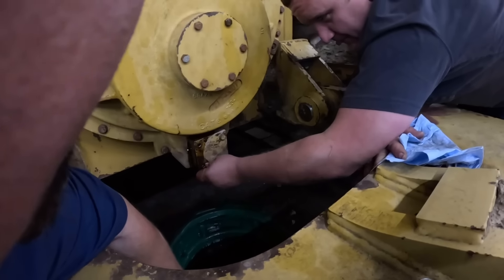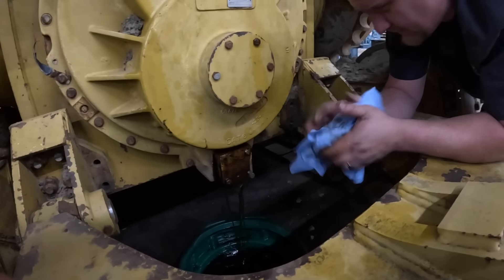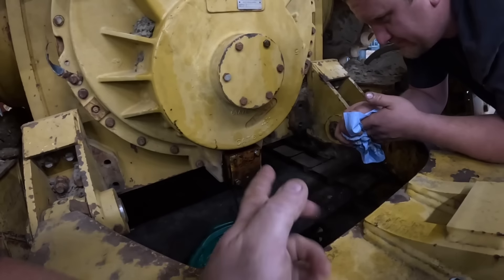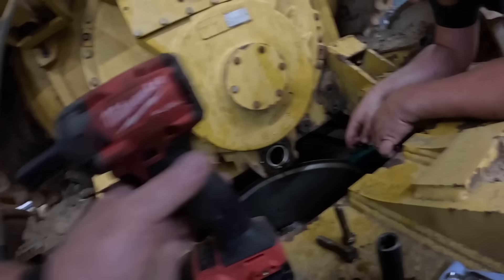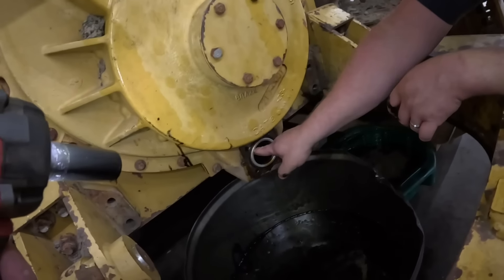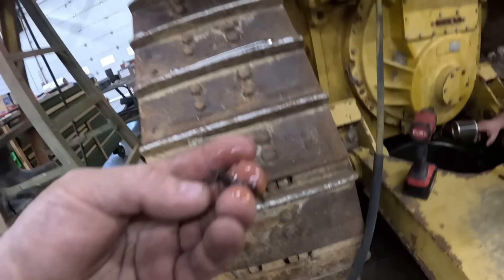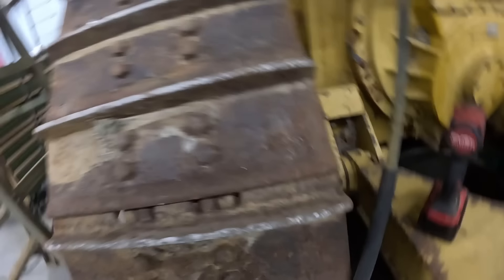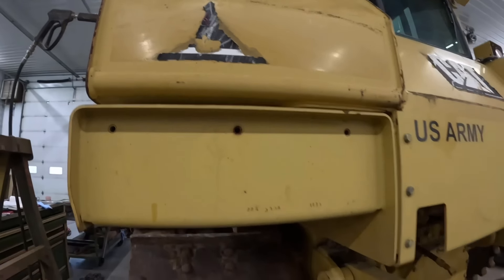The transmission filter was loose. This is a suction screen filter down here and they had one bolt missing. Somewhere they drained this thing — the plug is damaged. I also found a spring that looks like it comes from there. Got her — the filter looks clean. Normal stuff — just a little bit of sealant from when it was assembled. No metal, that's good. Let that drain out. We may need to get an air hose and blow back this hose, then drain it all back out.